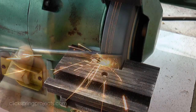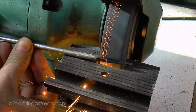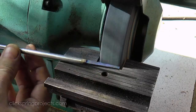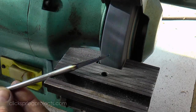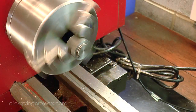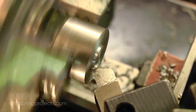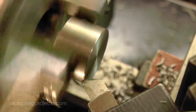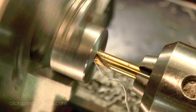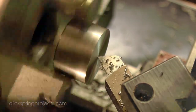Now, for this fabricated approach to work, the brass strip needs to be formed into a reasonably accurate circular band with a slightly undersized inside diameter. In fact, it's just one of several accurate tubes that are required for the mechanism to function. From an engineering perspective, accurate narrow tubes would probably have been one of the most challenging aspects of the original construction, particularly if it's assumed that the maker only had access to flat sheet stock to begin with.